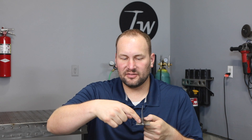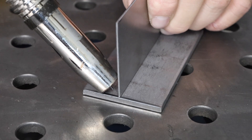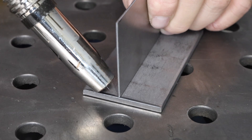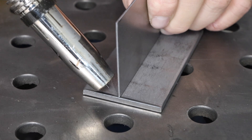You're able to see it really clearly when you tack weld, so let's go ahead and put a tack weld in here and watch what happens. I'm coming in at 45 degrees in and out of my material, right towards that joint. I'm in there with a short stick-out — my gun's pretty close, about three-eighths to a half inch stick-out of my wire. Before I start welding, I'm going to move my position back just a little bit towards the thicker plate.